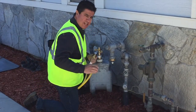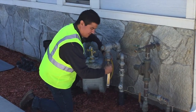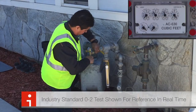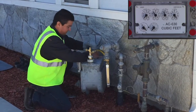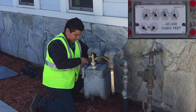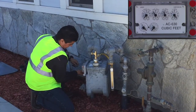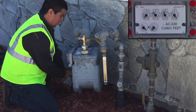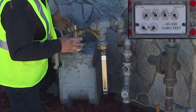So we're ready to go. What we recommend is that you attach your Rotometer first, or you can just slip the hose this way. The easy thing about this is all these fittings are quick connect fittings — you don't have to deal with messy nuts. From there, you're going to want to tighten this side, then turn your gas back on, and make sure that the valve is open so you know you have gas flowing from the meter to the Rotometer kit.